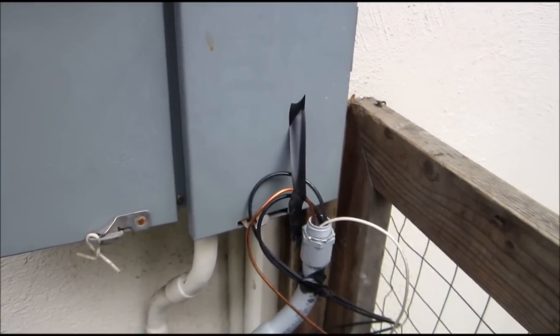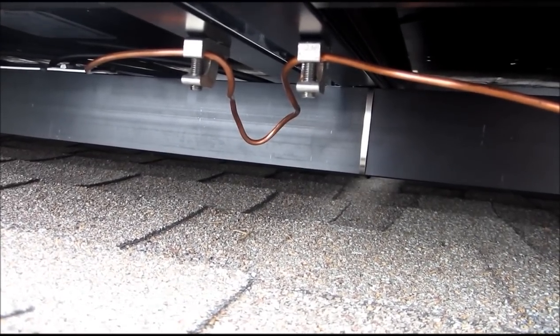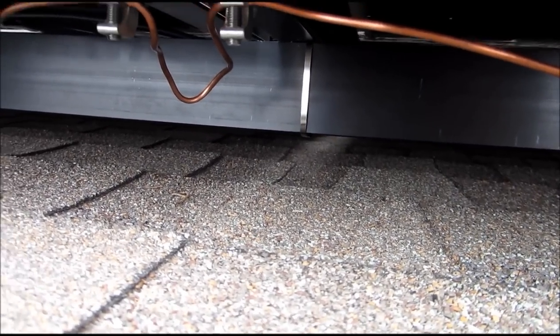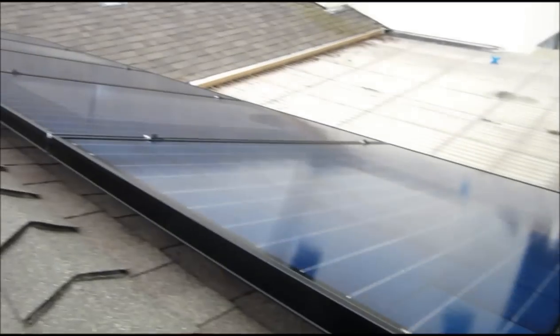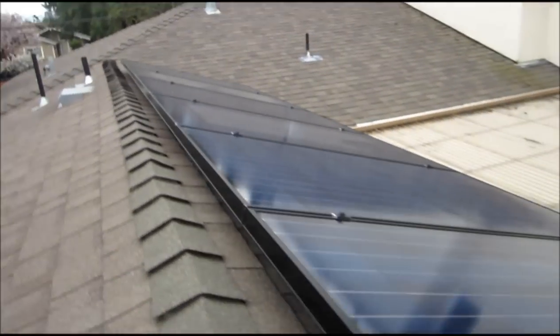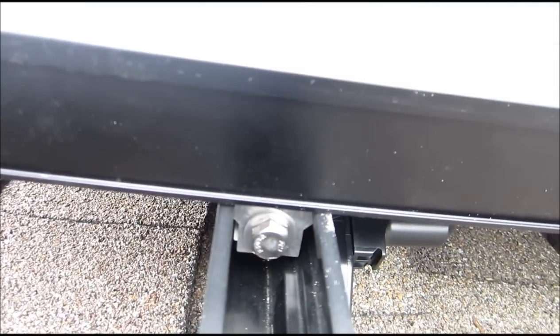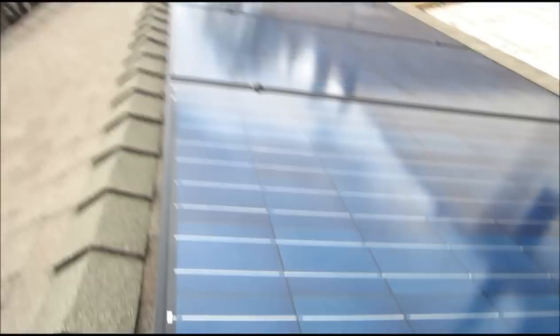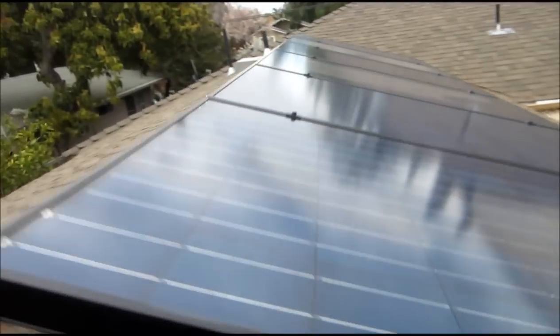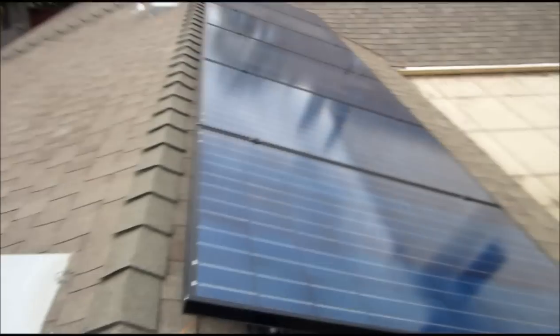I'm ready to install the panels. The 8-gauge wire is unspliced and bonded to each of the panels. I used stainless steel tie-wraps for cable management to keep the cables off the roof. Got all 6 panels up. You can see the mid-clamp bolts and the special end bolts at the ends — they're slightly different. Snap'n'Rack has great installation videos on YouTube for that. Got the cables off the roof with the stainless steel tie-wraps. Waiting for warning labels for the conduit and boxes, and then it'll be ready for final inspection.